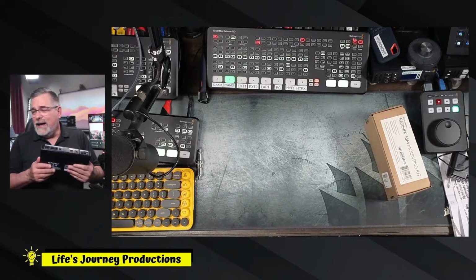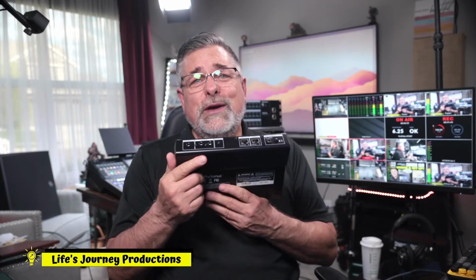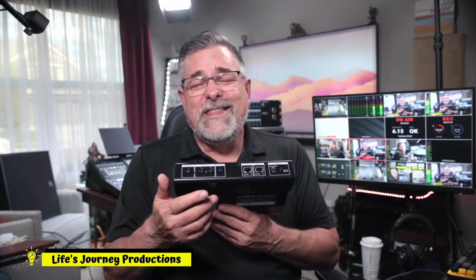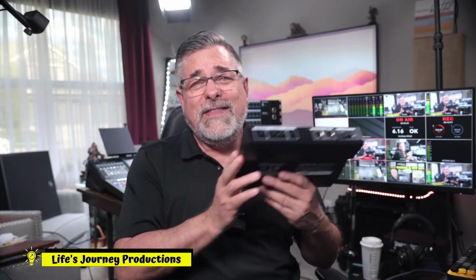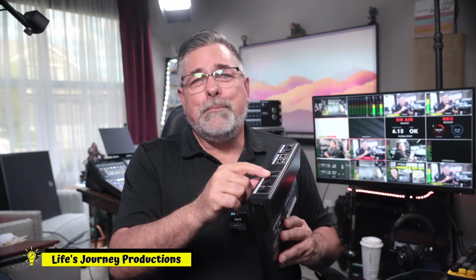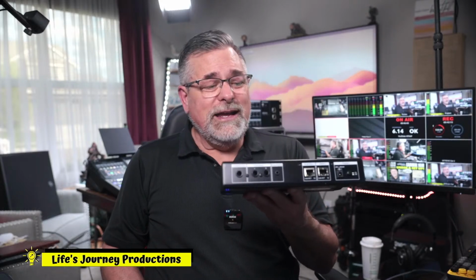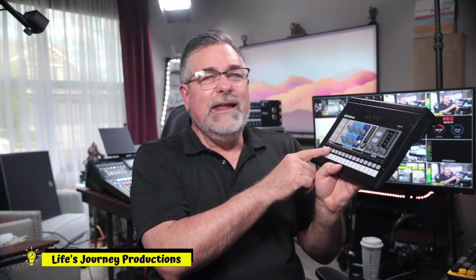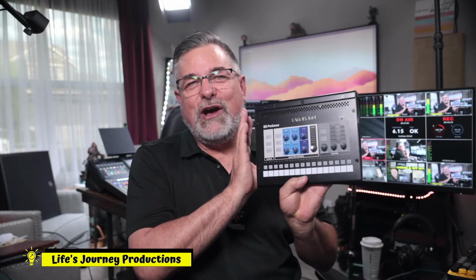What I like about this personally is that we're going to have a side tent. And what I want to do is put an 8.8 stage box over there. That way they can plug a microphone in. Then I'll assign that microphone to this in-ear mix through one of the channels, and they'll be able to raise and lower the volume of that microphone inside that other room. I'm also gonna plug the right and left powered speakers they have in there into this as well. And so this will be their soundboard. So if they walk in there and they need more projector volume, they'll be able to just choose that channel. And then if they want to bring up the house speakers, they'll be able to choose that channel. So I can assign that and make this its separate console in the other room.